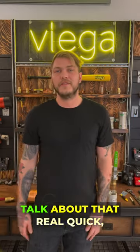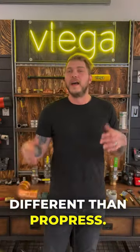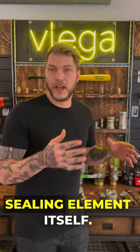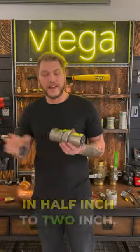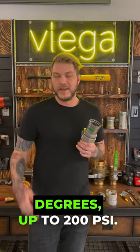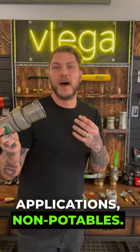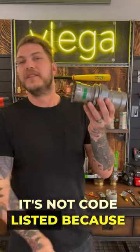Let's move over to Megapress. Your Megapress system is just a little bit different than ProPress. Everything on the Megapress side is going to have that grip ring, separator ring, and sealing element, but it also comes in different variations concerning the sealing element itself. The first one in that Megapress lineup comes in half inch to two inch — it's going to be Megapress EPDM. It still has that green sticker and green dot because it's the same sealing element as ProPress: zero to 250 degrees, up to 200 PSI. This is your basic hydronic type fitting for all hydronic, non-potable applications. Even though it has that zinc nickel coating and we can put it on galvanized pipe, we don't want to use it for potables because it's not code listed — it's a steel fitting.